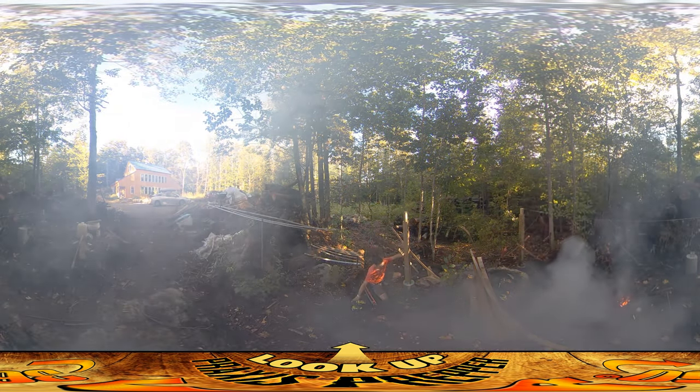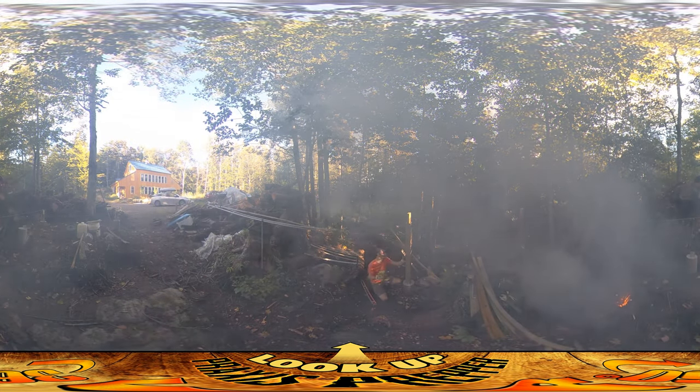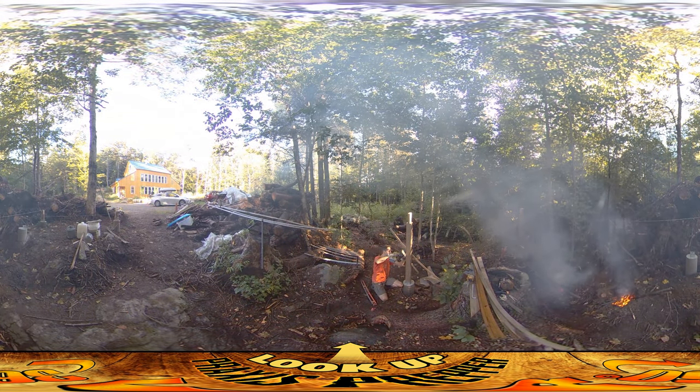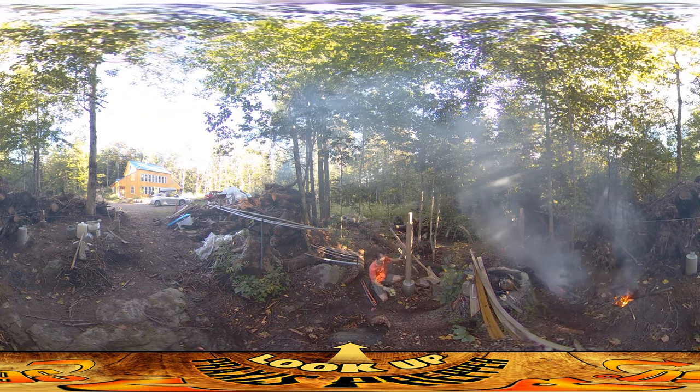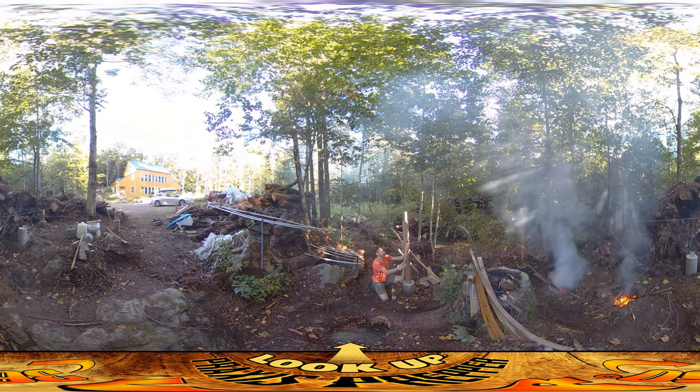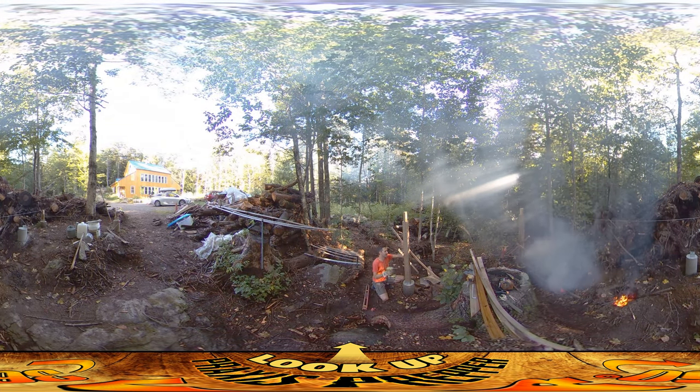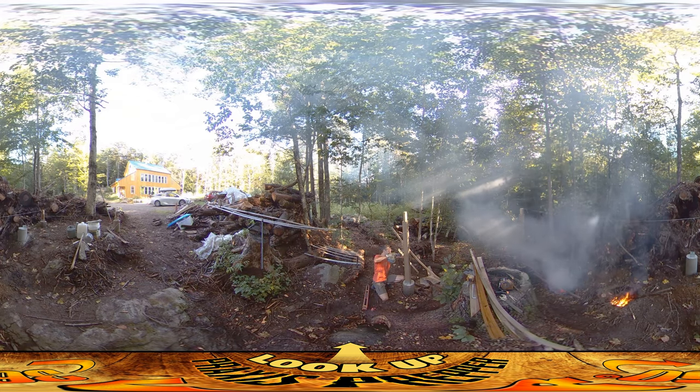Now that I've found what is plumb, I'm going to stick a screw in here. The reason I put the screw in first is because I want to get a general sense of what's level so I can put the screw roughly in the center. All right, so now we're going to get it pretty perfect — holding it, pinching the two things together — and drive this in.